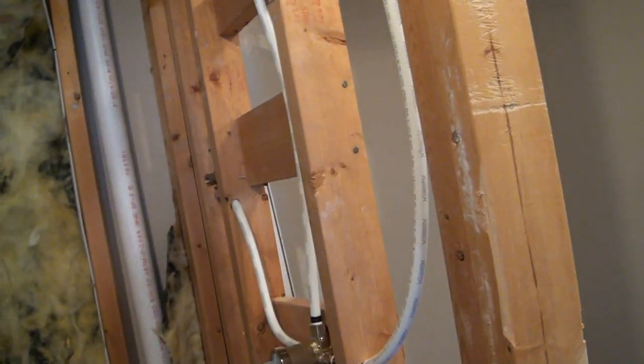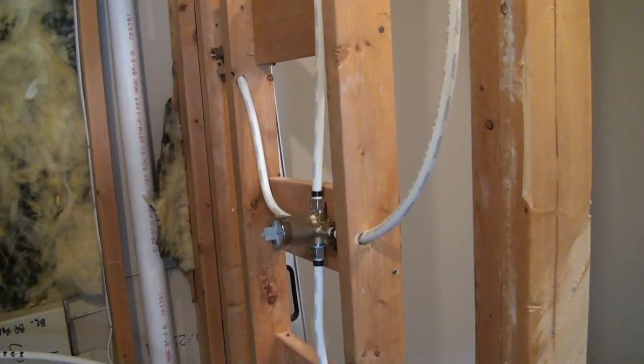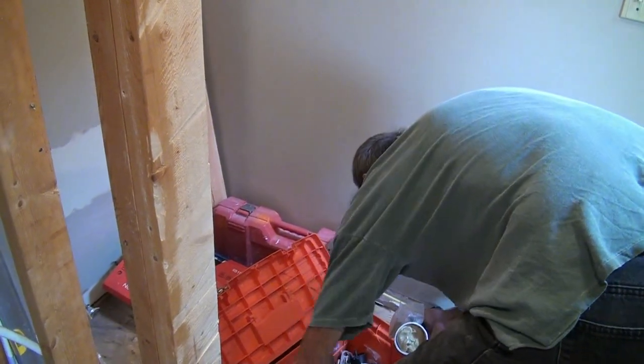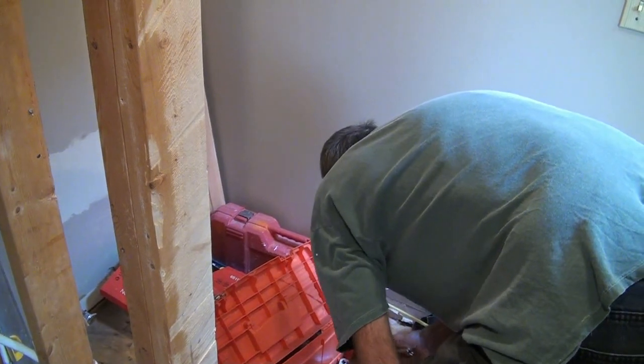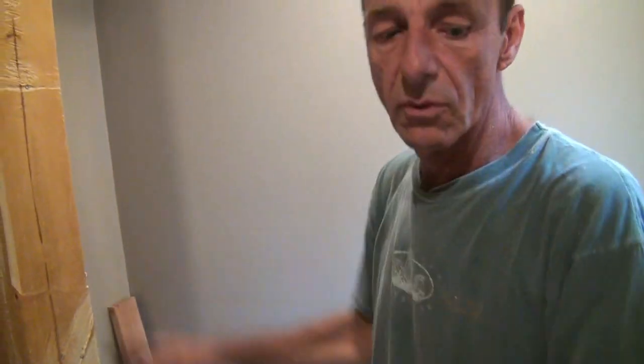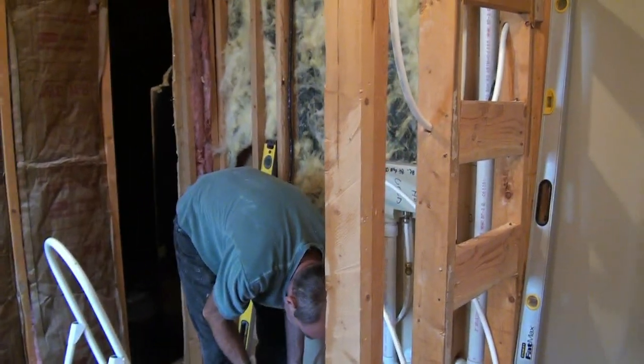We're going to pick up some 1/2-inch inline shutoffs so that we can shut the water off to the bathroom if we ever want to service the bathroom. We're going to pick up nipples and caps if we don't have any in here. 2 nipples and 2 caps. What do we need the nipples for? So I can put caps on these. Okay, yeah, 2 more nipples and 2 more caps. One for the shower head up there, one for the rain shower head. Okay. Yeah, because we got to fill these lines with water. All right. To make sure everything. All right, well, let's get a material list and let's get ourselves over to Home Depot and get the stuff picked up so we can finish this sucker today.